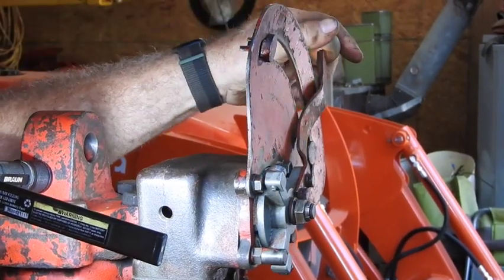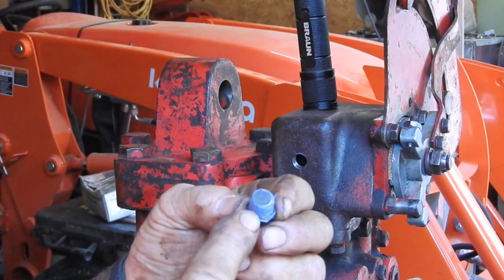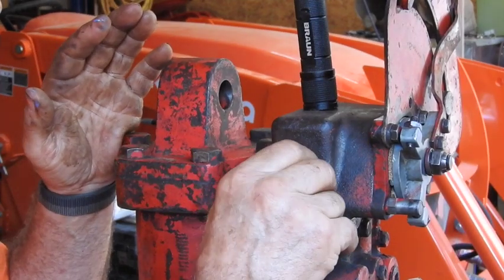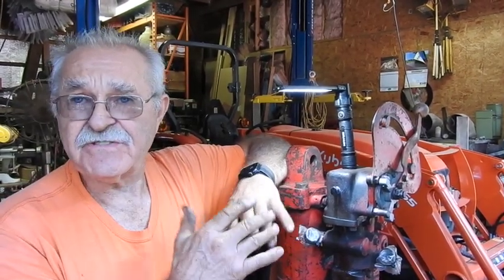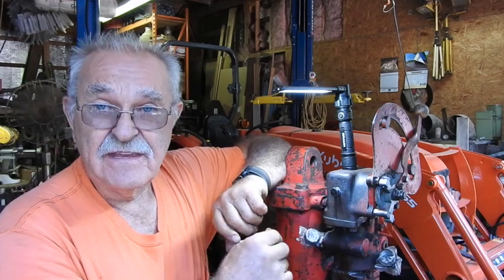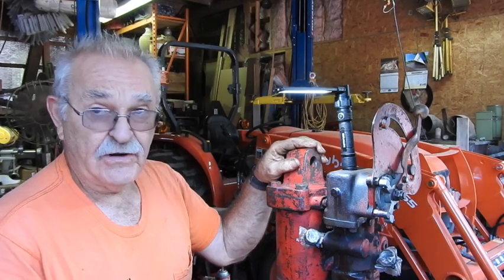Here's my quadrant doing what it's supposed to do. Everything is nice and tight — you can see everything moving inside the opening right here. I've got my pipe sealant; it's a blue pipe sealant. It's not a Loctite, but still be careful with your pipe sealant because if you get it real messy and get it on the inside, it'll cure over a period of time, flake off, and get drawn into the oil. So make sure you don't have anything beyond the tips of the threads whenever you thread these guys in. Now, the proper way to do it — if this is a total restoration situation — would probably be to completely disassemble everything. But the main thing you have to remember is to keep the system clear of any metallic particulate because that will kill your hydraulic pumps. Hydraulic systems have close tolerances and any amount of debris at all is detrimental to the system.